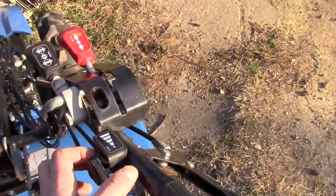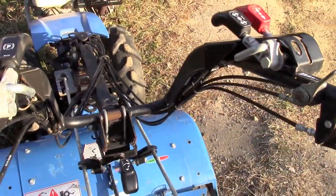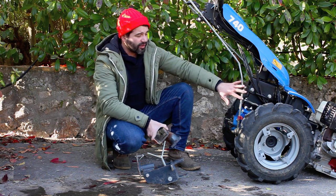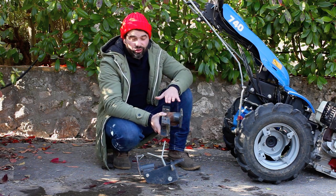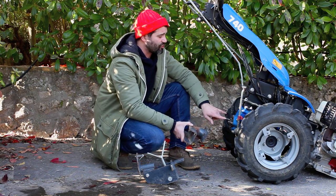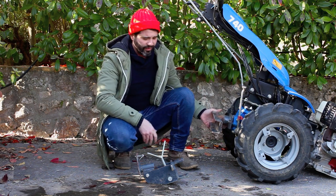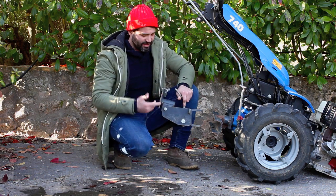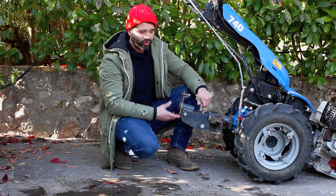Here's the accelerator: down will lower your RPMs, push it up to accelerate. So I'm going to show you some of the tools you can use with your BCS and other similar two-wheel tractors. You'll be pulling implements through the soil attached onto a toolbar, just like a large tractor. This is the toolbar for this BCS — it attaches right here where the PTO is, the power takeoff. You put your toolbar on there, then this is an intermediate bracket, and you'll attach your plow and other tools with a pin, pulling your tools through the soil like this.